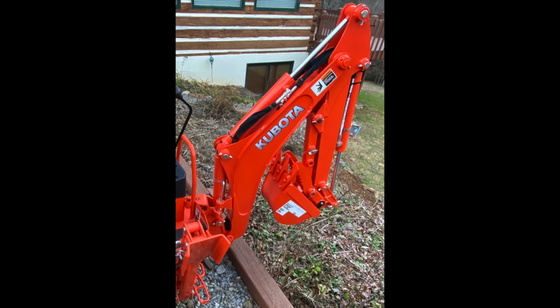When I got the tractor, I had to wait for a quality assurance, quality control check before taking delivery. There was grease on all the grease fittings, and there are many of them on this tractor. Don't assume that because there is grease on a fitting that the part is actually greased. The tractor was painted with some pins and grease fittings in place. I found out that one grease fitting had no grease the hard way.